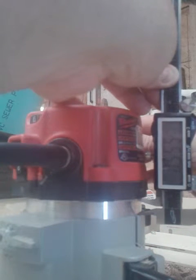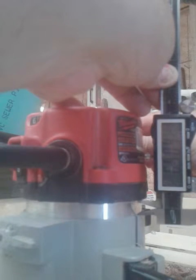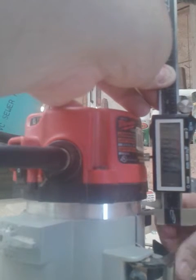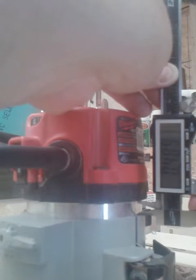I had this adjusted to within two thousandths and I was at four hundred ninety-one thousandths when I took it out. So when you put it back in, you can dial her down, and you can see the numbers going down. You can dial it right down. There's my 491. I'm going to go ahead and hit 490, then lock the router and pop to 489, but we're good to go because I've got a three to five thousandths clearance on my tongue and groove.